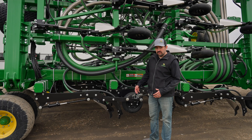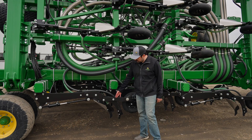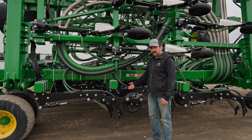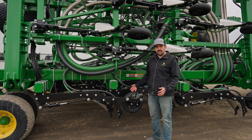On this drill, when you get up and close, you'll notice that on the left side of the drill, the seed knife is on the left side of the fertilizer knife and tapered to the left. On the right side of the drill, the seed knife is on the right side of the fertilizer knife and tapered to the right. This allows the drill to be pulling level and equal throughout the field.